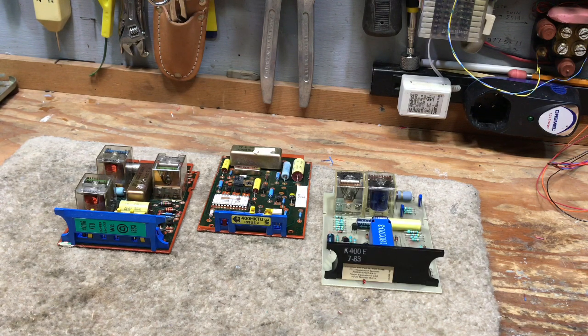The reason for the grounded ringing in the earlier days was at the central office, where the ringing equipment is. One side of the ringing generator is connected to a 48 volt power supply. Then the output is connected to a ringing transformer, which imposes up to 105 volts AC at 20 or 30 cycles onto the phone line, and then it goes out the ring side of the phone line to the KTU, and then through the key system ground, it would end up being grounded, so you would then have a completed circuit. So when they sent ringing generators on the line, you would operate the line card.